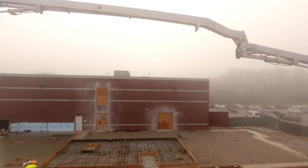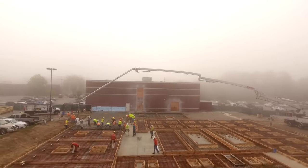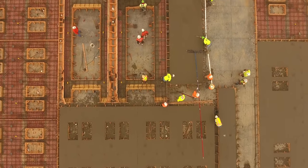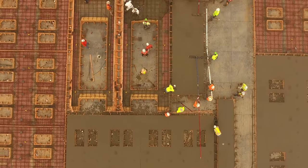I'll tell you a little bit about the tilt-up process. We start with the board floor — a permanent floor that we'll build on later — the interior walls for that floor. And on that floor we form the walls that will be the exterior walls for the project.